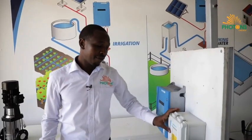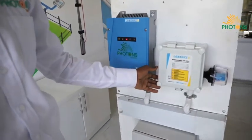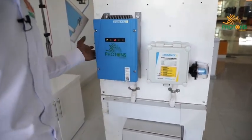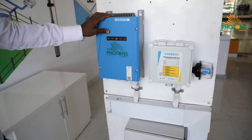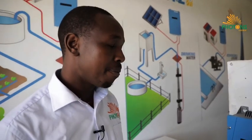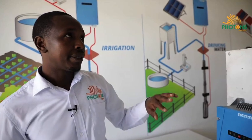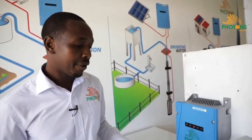Normally with a large array you have a PV protect to safely disconnect the array from the controller. This unit you see here is the pump controller — it controls the operation of the pump because these pumps run on a variable speed drive, and the controller matches the power produced by the array to what is needed by the pump.